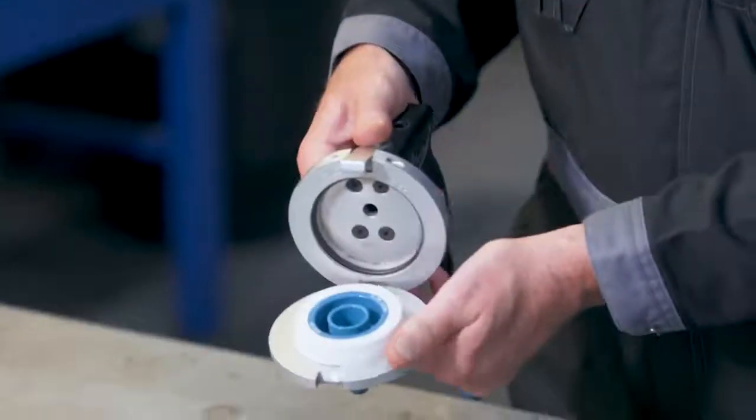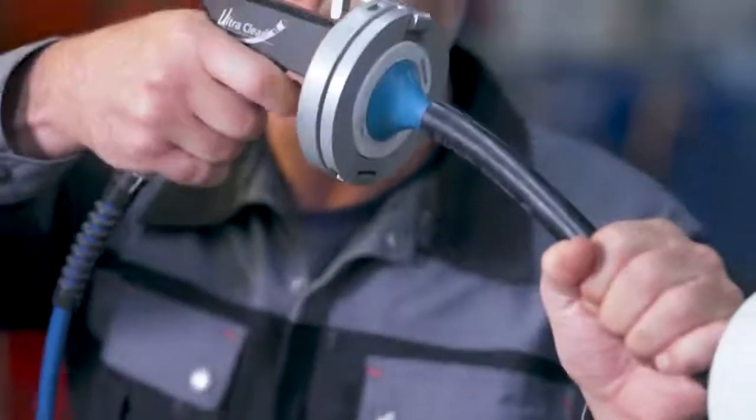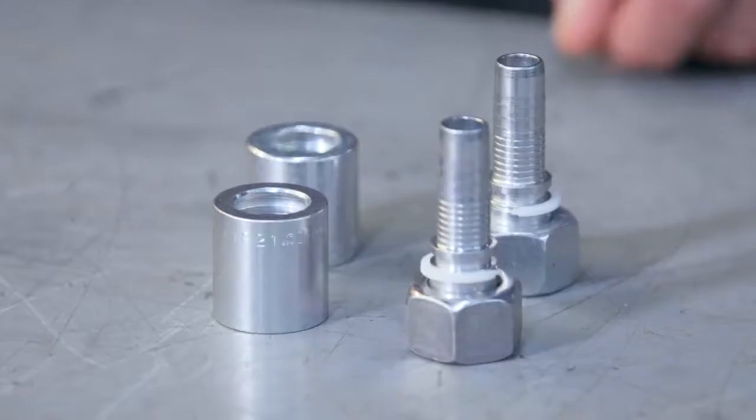Afterwards, make sure you clean all dust and residue from your hose to avoid contamination. You can do this by shooting a cleaning projectile through your cut hose as well as through your assembled hose. To do this, connect your clean launcher to a filtered, regulated air source, load the recommended nozzle and cleaning projectile into the launcher's faceplate, and close it. The safety release bar will lock it into position. Insert the nozzle into the hose, secure the other end into a container or bucket, and press the trigger until the projectile has exited the opposite end. Repeat until the hose is completely clean.